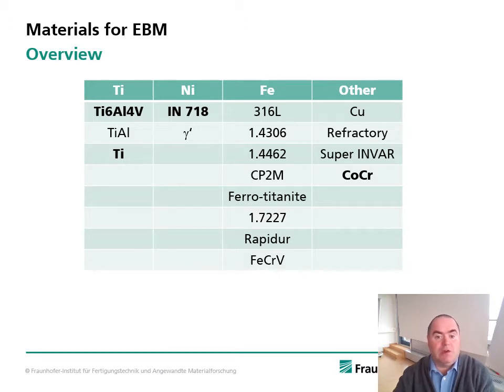The combination of elevated temperature and vacuum makes Electron Beam Melting very suitable for certain materials — particularly those containing a high amount of very reactive elements. A very good example are titanium alloys and titanium aluminide alloys, for which the vacuum ensures a very low impurity content throughout the process. Furthermore, the high process temperature ensures that the level of residual stresses is comparatively low, as is the amount of support structures needed.